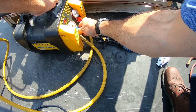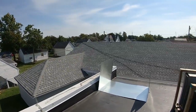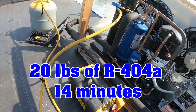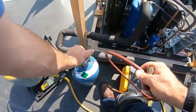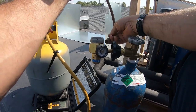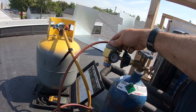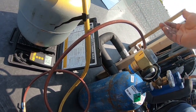Just kind of listen to it. We can get it at an angle so we can see what we've got going on — 20 pounds in there, that's about what this thing holds. This regulator is awesome, made by Western. The cool thing about this one is it's the 250-pound model. They've got 500 and 650 as well, but basically when you have it on, you've got off, braze, purge, and test. Test will take you up to 250 for this particular model.